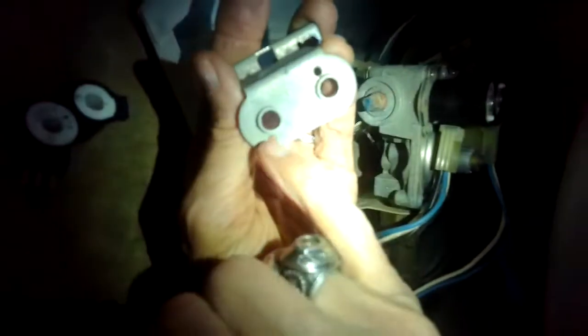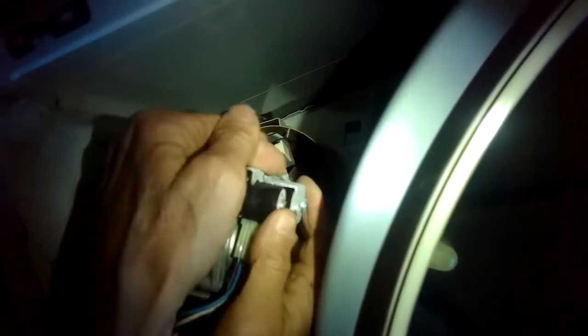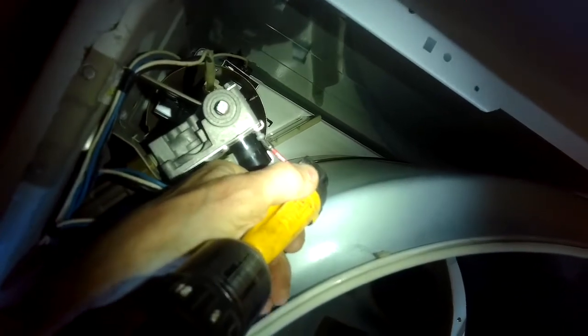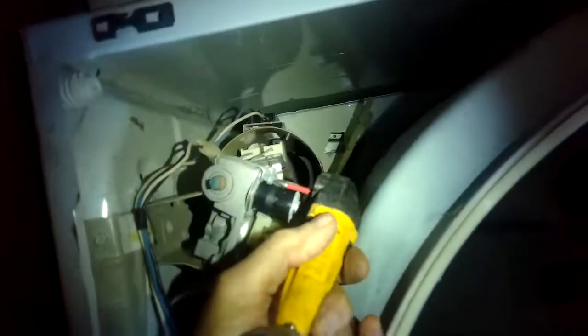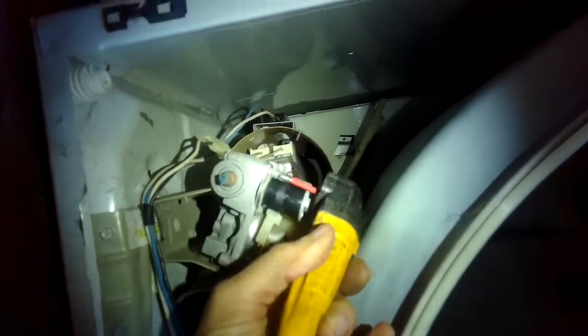Okay, that's all done. I'm going to put this bracket back on. The bracket has holes, and these have indexing pins — the pins go inside these holes. Wiggle them around until they index in. Now I can see the white pins go in, and I'll put those two Phillips head screws back in. So to summarize: a gas dryer that isn't drying well — first check the vent tube, make sure it's clean. Still doesn't do well, clean the filter. Still have a glowing igniter and a flame but not much heat? It's probably these gas coils — primary and secondary gas coils.